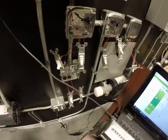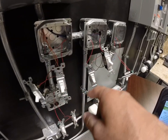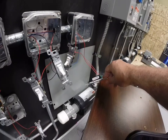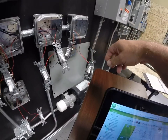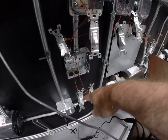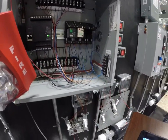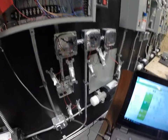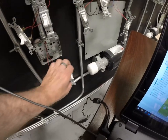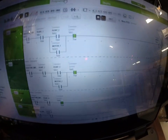You'll see I've got a bunch of switches going on here. This right here is my selector switch, float switch one, float switch two, float switch three, float switch four. Then I had a reset button — my reset button is up here — overload one, overload two, and I've got a fire alarm horn for a buzzer. At this stage, in order for this to work, I need to turn my overloads on.